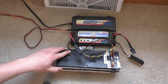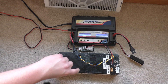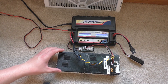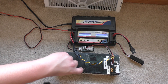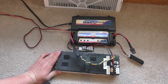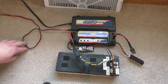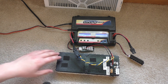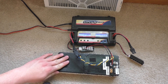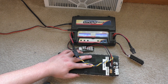Just so you know, this pack is actually a 3S 8P configuration, which means I have three sets of eight batteries wired in series. There are eight batteries in parallel — the individual 18650 cells — and those three sets are wired in series to give me the 12-ish volts, or 12.6 volts at its highest. That's about all you really need to know about lithium battery charging. I'll try to link in the description a few different chargers you can use and maybe a few videos explaining how to use them. I just wanted to show you how I charge this big battery and how I do it personally. That's it for now, guys. Bye.